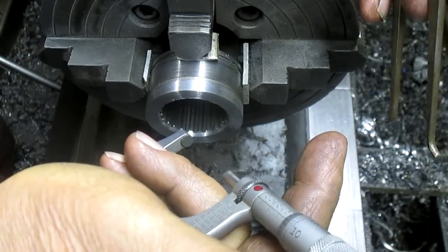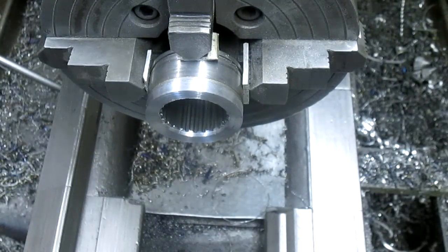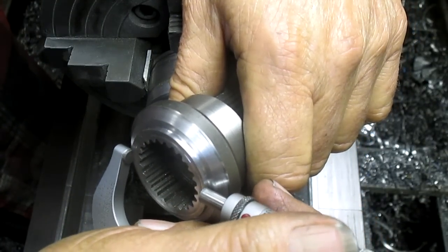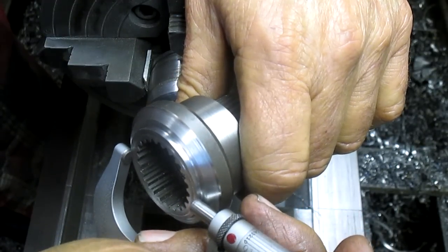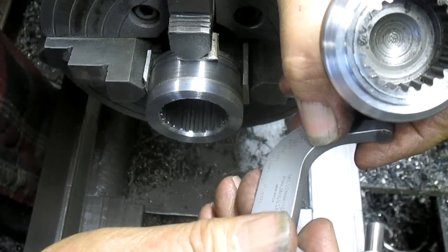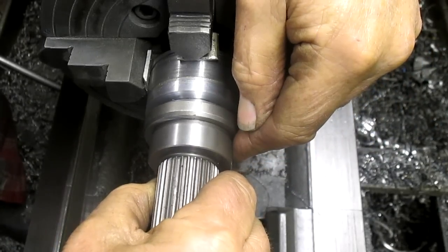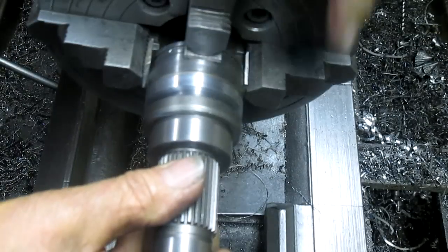And we are looking at 575, 586. And our measurement here is 575, 584 and a half. So that's a 2000th press right there, supposedly, although I'm not trusting it because it's not feeling like a press. We are so close.